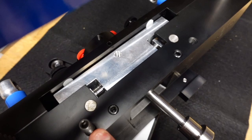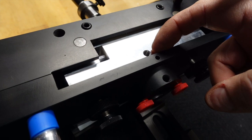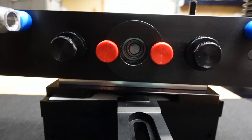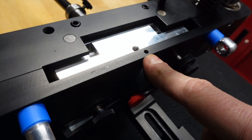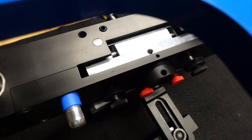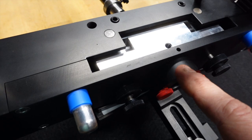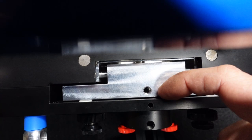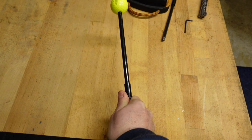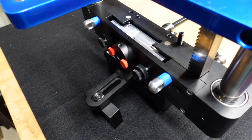Even for a 22-pound gun you really don't need that fourth screw — it just makes tuning easier. Before I flip this back over, I want to show you two more screws. This one holds the bearing in; it just needs to be snug. You do not want to over-tighten it — if you crush it down too much you will actually deform the bearing and cause really erratic motion in your joystick. Just snug is all you want. Then the screw on the big block controls the rotation of your joystick — you can loosen it or tighten it however you like.